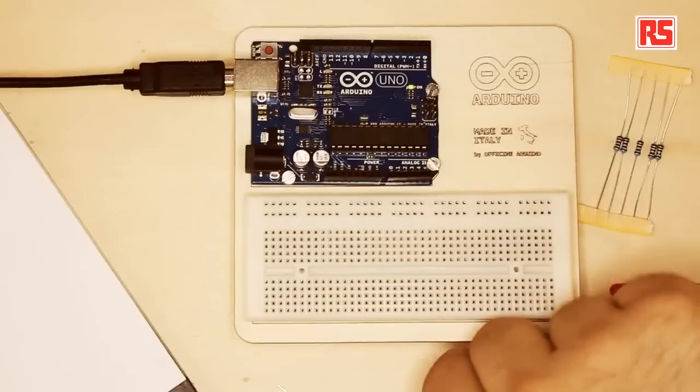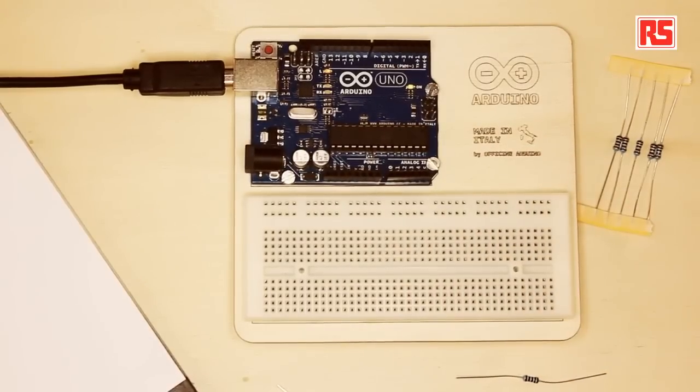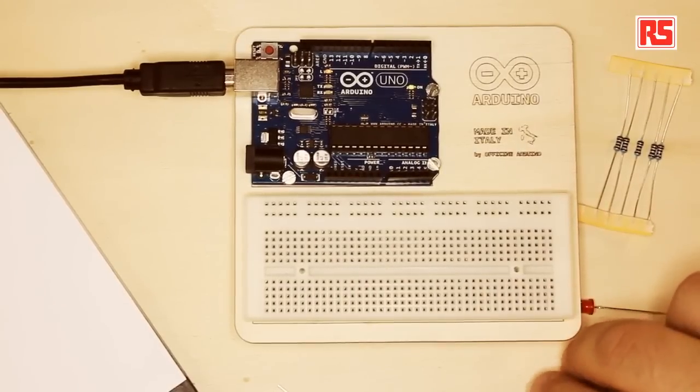The first circuit we're going to build will have a source of electricity pushing the current through the wires, a number of wires connecting to the button, then the button will open and close the circuit, and when the circuit is closed the current will flow through the LED. We'll also use a component called a resistor. The voltage of our battery is too high for the LED — we're going to use 5 volts, which is the standard voltage for the Arduino board, but this LED only needs about 1.7 volts. The resistor will limit the amount of current that flows through the LED, keeping it at the optimum amount of voltage and current.